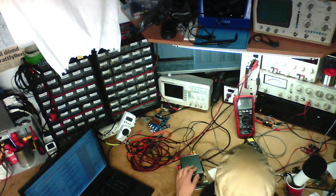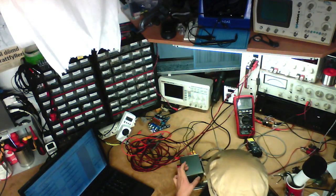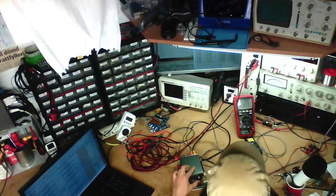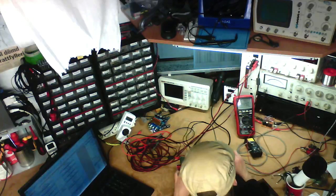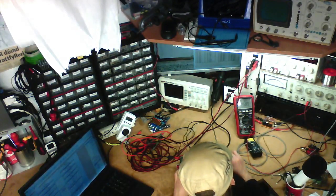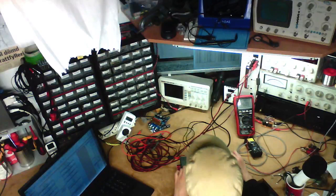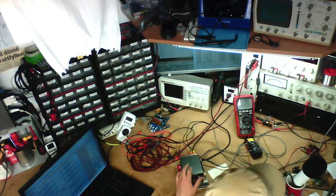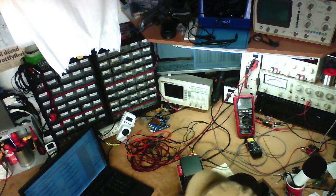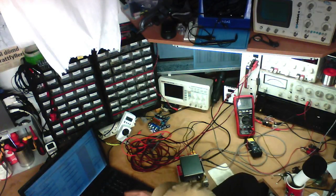Right channel, TPA 3116 Breeze Audio, 10% distortion. Right channel, 14.6 volts. And lo and behold, it's exactly the same, which is what you'd expect since we're just voltage clipping. So 26.6 watts.